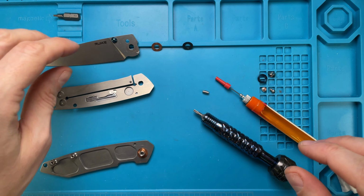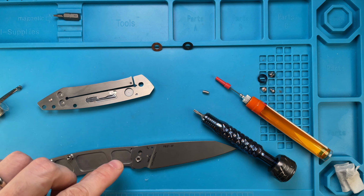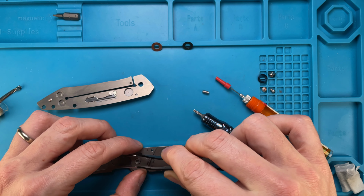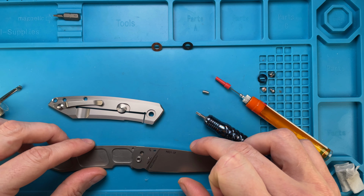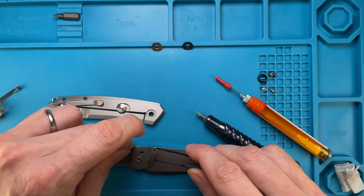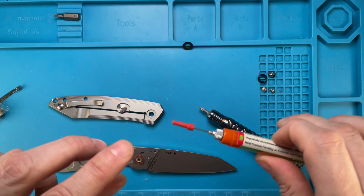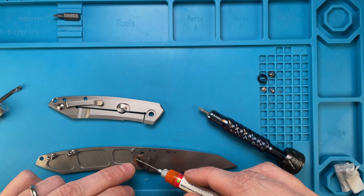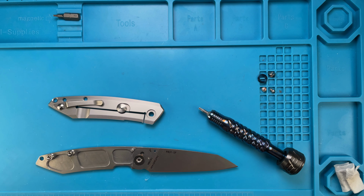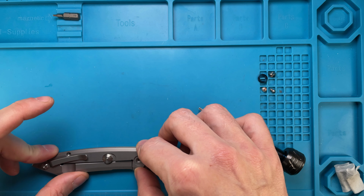Okay, so we've got that, and then our blade, it's right over here. So you see also nicely D-shaped pivot, so we're gonna have to just align it because it's keyed in on this side, so this has to match when you just put that in. And here you have your stop pin, like so. And then we said this guy is here, and just a little bit of nano oil also, and here you go. Also on that side you can just push it down, made it adhere like so, and that's good to go, guys.